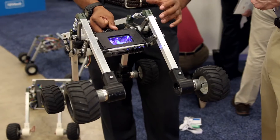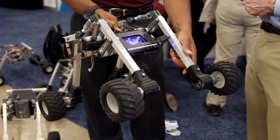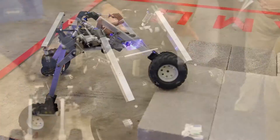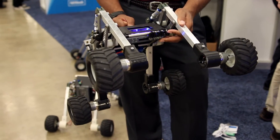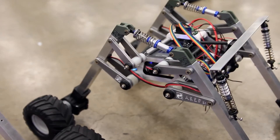The suspension on this is a little bit interesting — it's kind of like what you might find on a monster truck. The suspension is actually what's called articulated suspension, meaning if you were to take the leg in the front and push it up, the legs in the back would go down. This is basically to simplify the mechanical aspect so that if it is going uphill, the entire robot would actually shift in that direction rather than just moving forward at the same angle but allowing the wheels to move, causing stress on the joints.